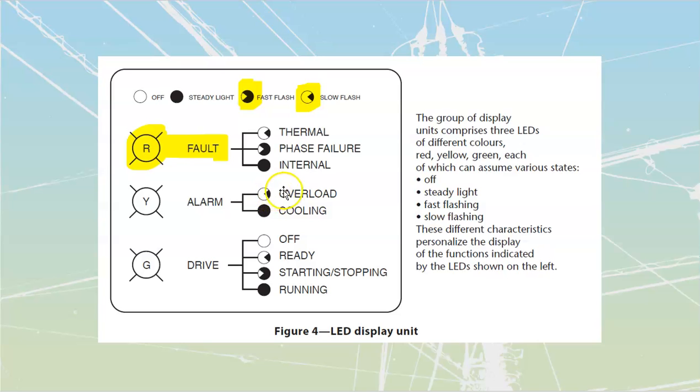Same with alarms — a slow flash means an overload is happening, and if it goes on too long the drive shuts down. A steady light means it needs cooling. For the drive status light: no light means drive is off; slow flash means it's ready and sitting there; fast flash means it's ramping or starting; steady on means it's fully running. Another type of flash coding uses counted pulses — five pulses then off for two seconds, and it repeats. The manual lists what one flash, two flashes, three flashes means — you count the pulses and look it up. It's a way to use a single light to indicate numerous different faults.